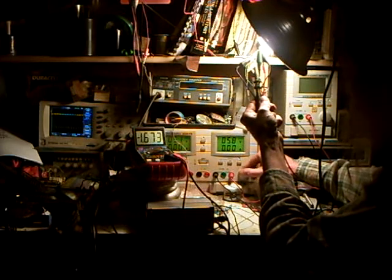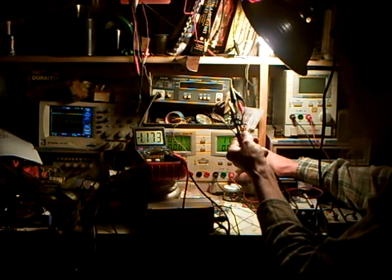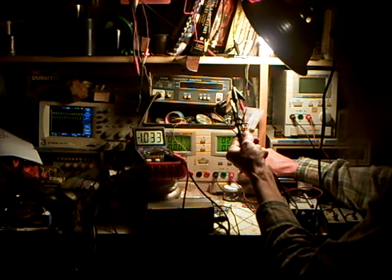Even on 4, 5, 6 volts, we don't really change the gain with the voltage either. It's just a question of — after I run the voltage down, we'll just start clipping at some point. The gain doesn't really change. The gain is pretty rock solid.